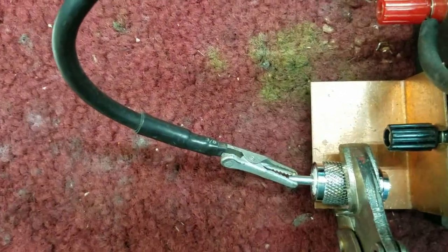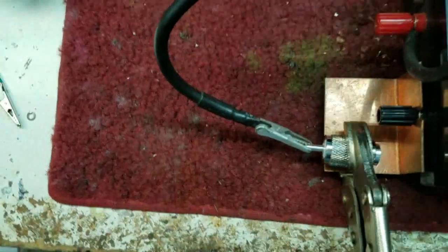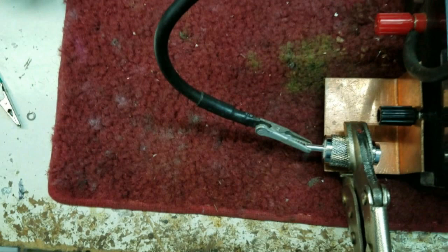The important thing here is that this makes the connector the highest voltage breakdown part of the system, so other things will go first. The cable might go at 5,000 or 6,000 volts depending on what kind of cable you have. Barrel connectors will arc over and fail at less voltage. But the connector itself has a lot of headroom, and that makes the connector reliable.